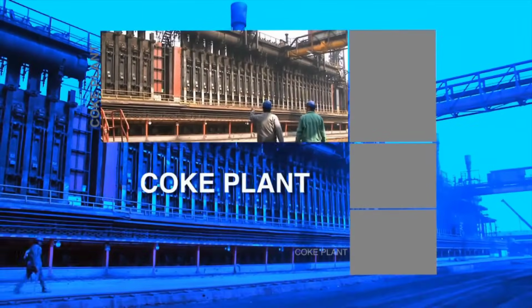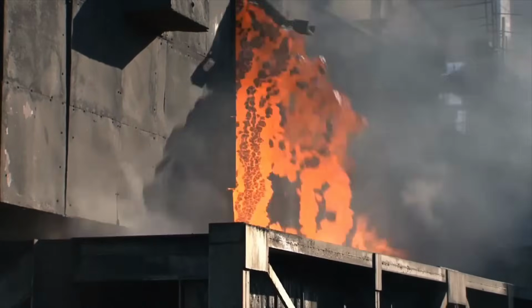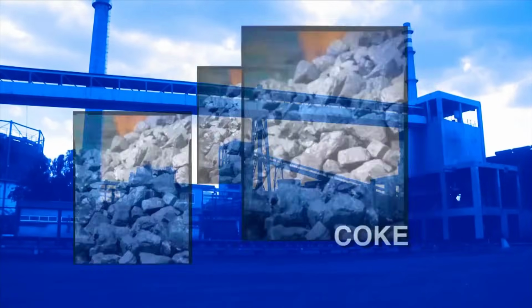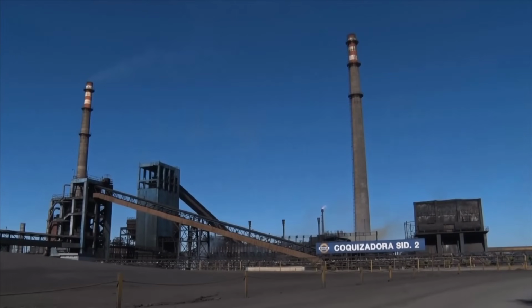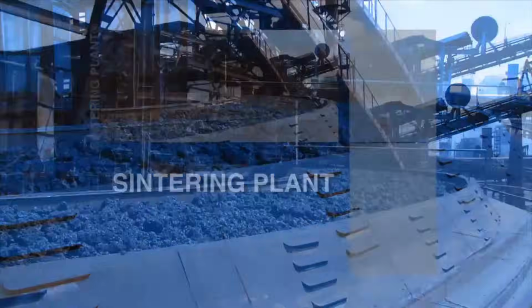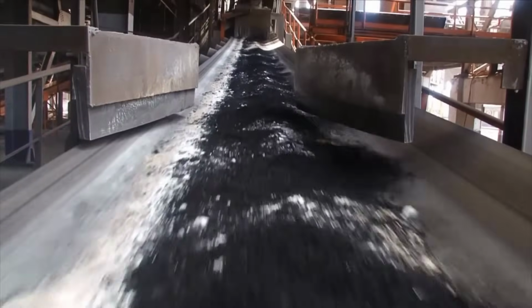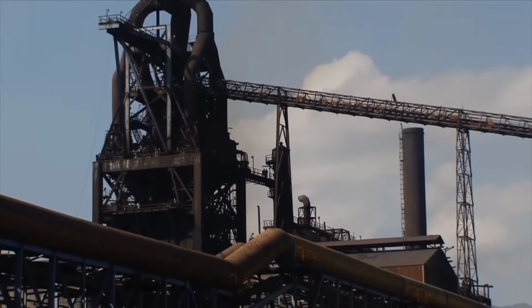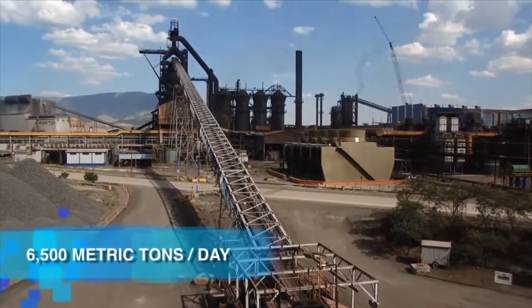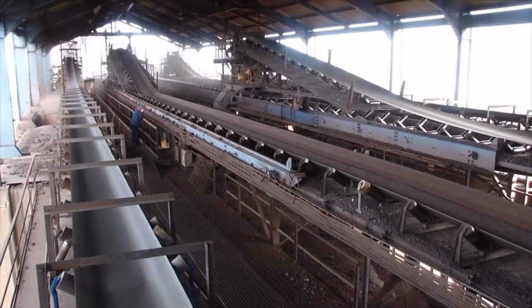The blast furnace is a towering structure standing over 160 feet high, internally lined with refractory bricks. It plays a pivotal role in the transformation of raw materials into pig iron. Iron oxides, along with limestone, dolomite, and coke, are deposited in layers within the blast furnace. Hot air is introduced under pressure, creating an environment of up to 1650 degrees Celsius. This process reduces and converts the raw materials into pig iron, which is collected and further processed.